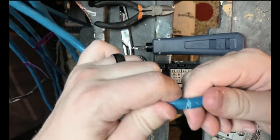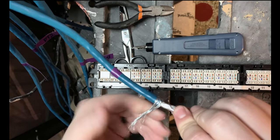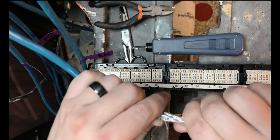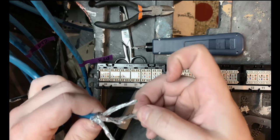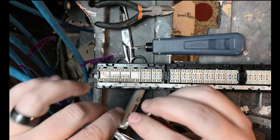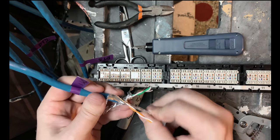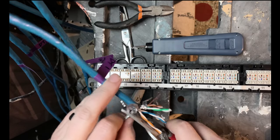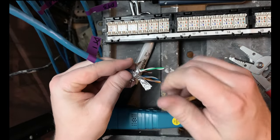I'm just going to remove the outside casing, and you can see with Cat 8 it is shielded to hell. We've got this mesh shielding that we're going to get rid of, and each individual pair is actually wrapped in aluminum foil — essentially a foil shield. We're going to have to peel that back as well. This is the reason that the tone does not come through the outside of the jacket when toning. With Cat 5, 5e, or 6 you can find the tone all the way on the outside; with Cat 8, it's very hard to pick up for that reason.